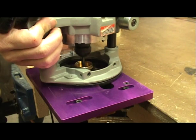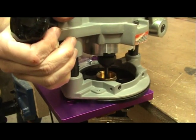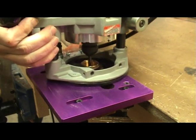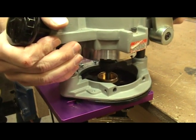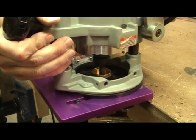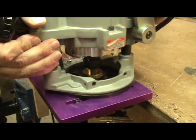With the neck and jig clamped in my vise and using the proper safety equipment, I place the router on the jig and plunge slightly into the area I want to remove. With the guide bushing up against the edges of the slot cut into the jig, just run the router around the edges of the template. Don't try and cut the entire depth in one pass. You want to make several passes until you are all the way through the peghead.